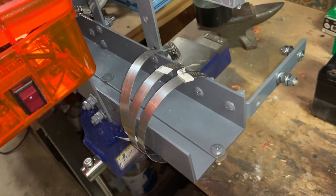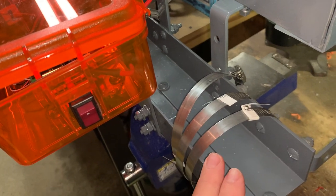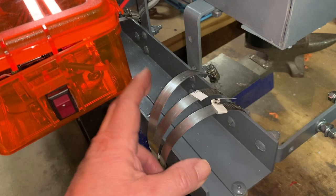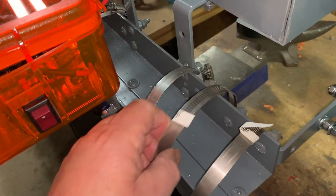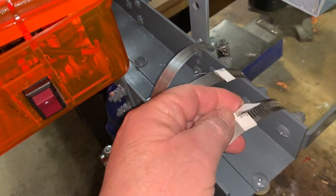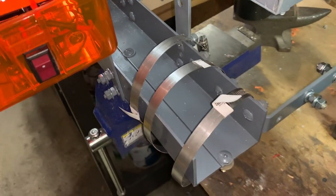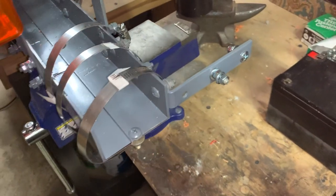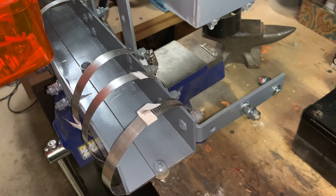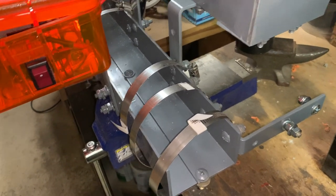Your motors should be M41 inline motors — M41 Pronto motors. They are inline, meaning the gear is in line with the motor housing. I use steel brackets from Ace Hardware — four-inch brackets — and the M41 motors fit into this bracket. You'll get the Pronto M41 wheels along with the key to put the 10-inch wheels on. You're going to remove the back wheels on your mower; try to get a push mower with the same size front and back wheels.